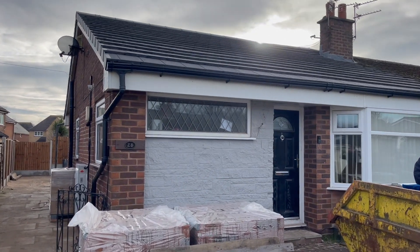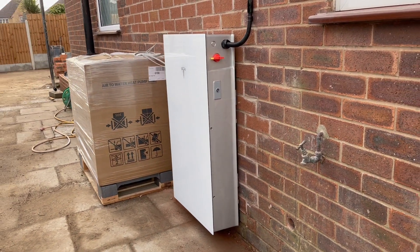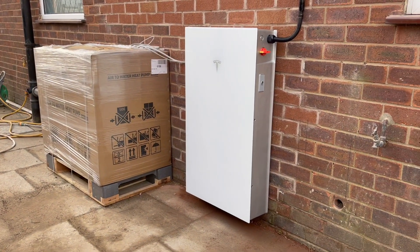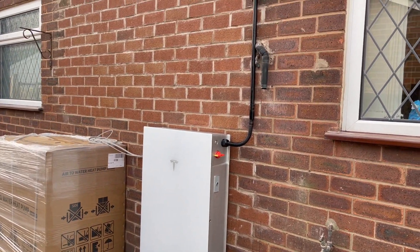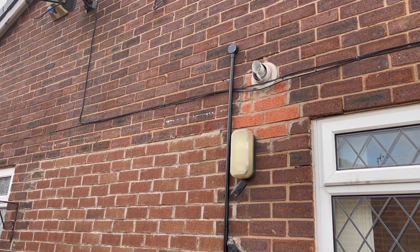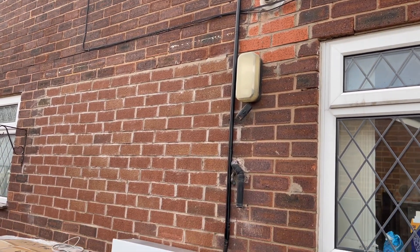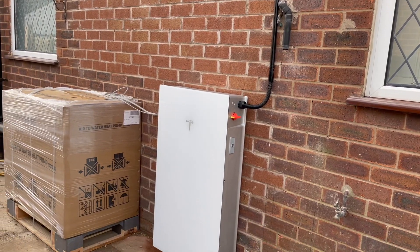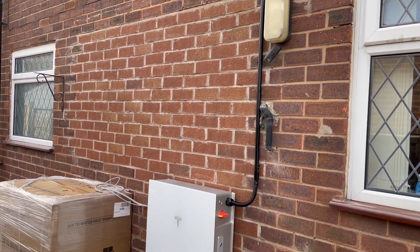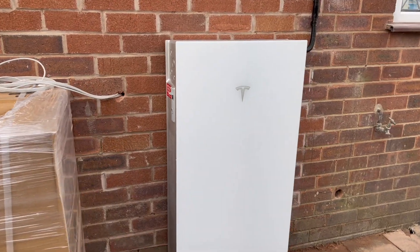Alright then, end of job. I'll show you round. This is the Powerwall 3 — that's how we've done it. We've actually gone into the back of the unit for the AC side, to make it look nice and neat. DC side we've come externally. The AC is going to be boarded and stuff like that, so I tend not to run the DCs internally if it's going to be boarded and plastered — DCs always have to be surface mounted where possible. So yeah, DC is external. We've also put a DC isolation point up there on that gable end — it's always good to have one of them for good practice. So that's the DC side, Powerwall 3.